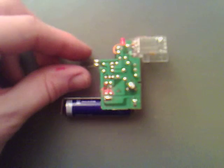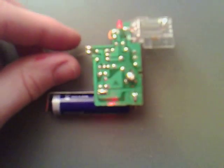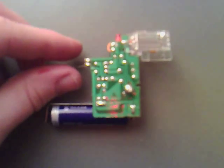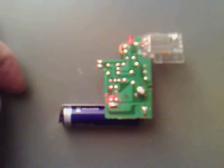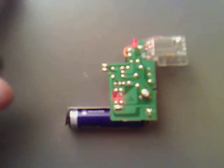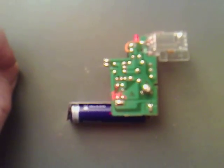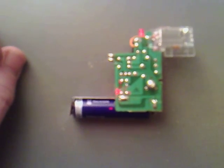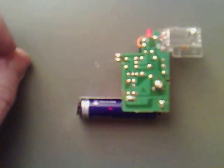I've got a massive blob of solder on there now. You can see the red light's up — a bulbous bit of solder. So it's working fine. And now I want a way of triggering it so it will trigger by itself. I'm thinking a neon — maybe one may do that. Hopefully when that gets up to the correct voltage it will go, and then the neon will switch on and act as a switch. So I'm just going to grab a neon and solder that onto it now.